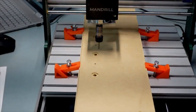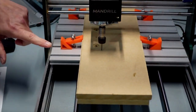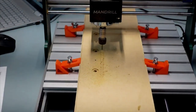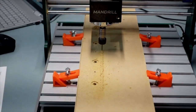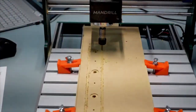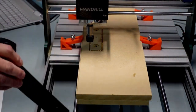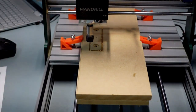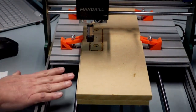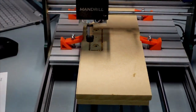The machine is now cutting the fence frame score line — just a shallow outline to show where everything will line up. If this outline isn't right, stop early; but it looks good at 40.275 feed rate. The cut is done. Everything looks good — next time I probably won't go as deep on the score, maybe just 2-3mm is enough for an outline.